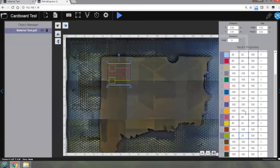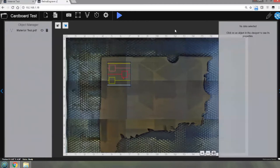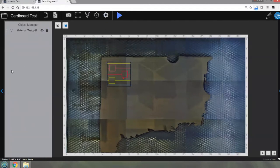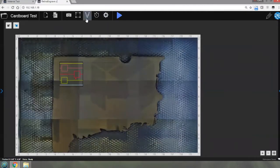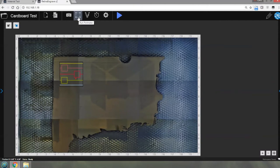I think that's all the colors filled in. I can see the position and size of the actual thing - it's just over two and a half inches, which is pretty good. Now I need to close those panels so I can see the bed. This button here runs the perimeter. We can run the perimeter of the job, which is going to tell us if it's close to the actual object on the bed and whether it's where I want to cut. I'm going to run the perimeter - it's going to run the head around so we can see the dot on the material.